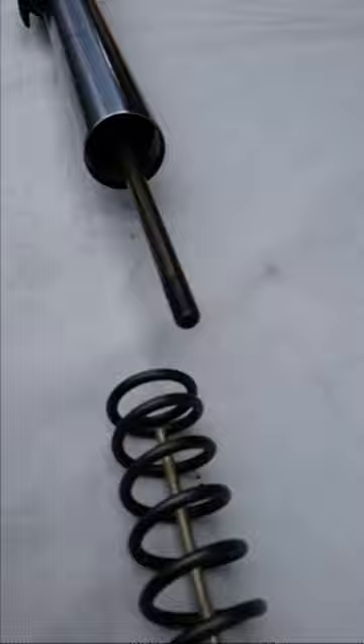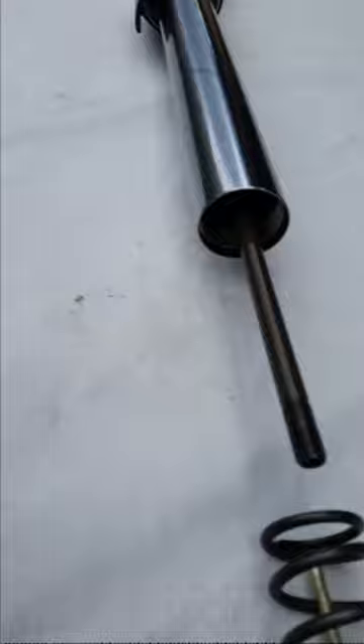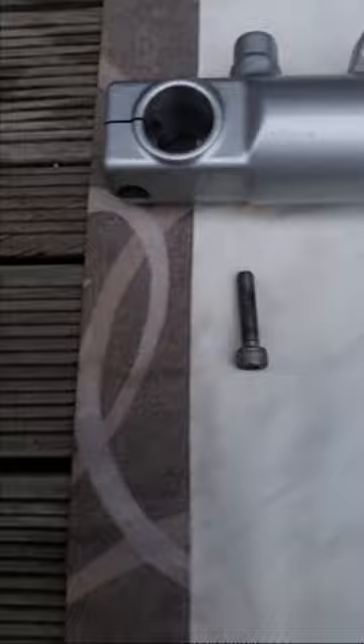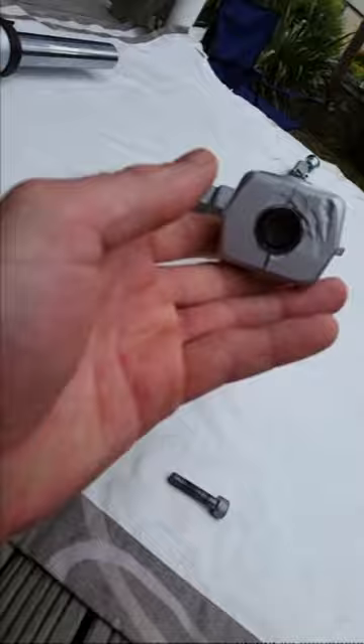It's got a top and a bottom, so I put tape to mark where the top is. And there's that rod there that goes inside that tube. This is like the right front fork, and that is a bolt which goes into there. You've got to undo that in order to get to the bolt which is in there - it's a big hex bolt.